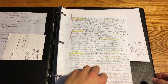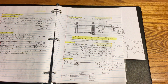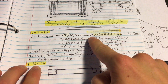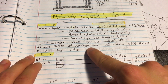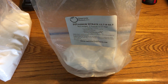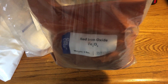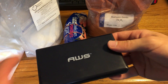Now we're ready to start making the fuel. The recipe is a 50/50 mix of powdered and granulated potassium nitrate, powdered sugar, and an additional two percent iron oxide. It's melted at around high heat. The composition is 63 percent KNO3 and 37 percent sugar. So we've got regular potassium nitrate, powdered potassium nitrate, powdered sugar, and iron oxide.